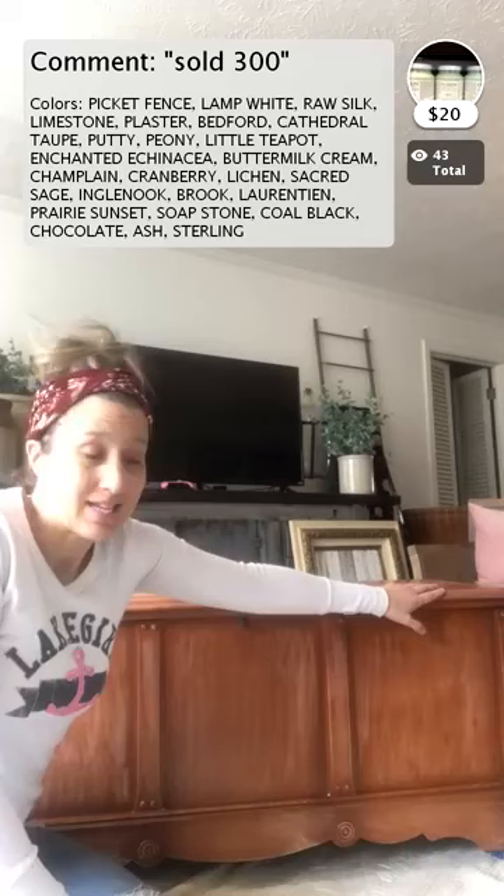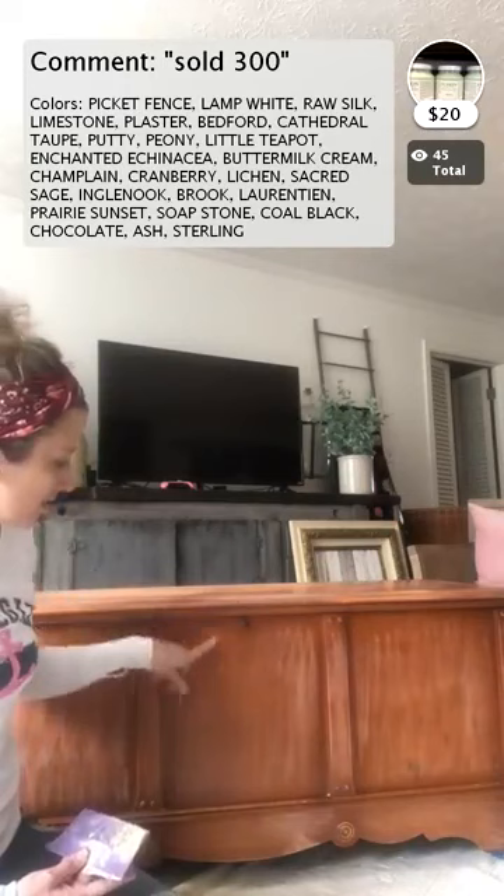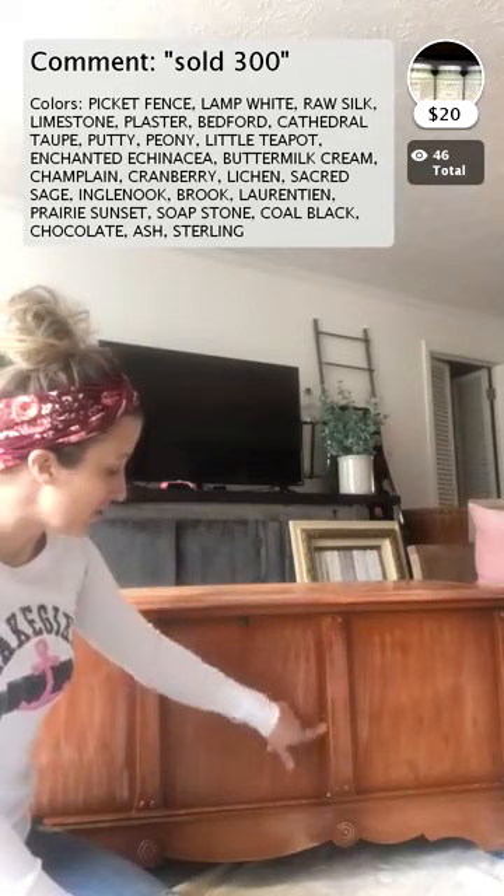All I do with a piece like this is give it a good washing — I use dish soap and water, but we also sell TSP in the store from Fusion, which you can mix with warm water and wash it all down. The second thing I did for this piece, because it's a really slick surface, is rough it up with sandpaper. It's not meant to be a remove-the-finish type sanding, but more of a cleaning sand — a fine grit, going with the grain to just scuff it up. Then I washed it down again and used a dust buster to get all the sanding dust out.